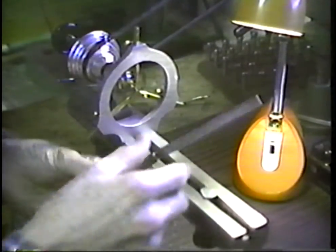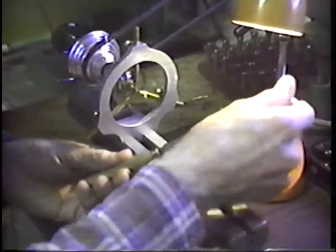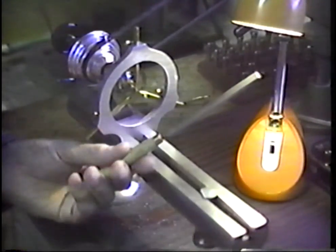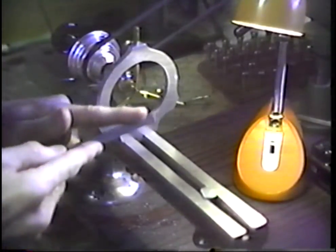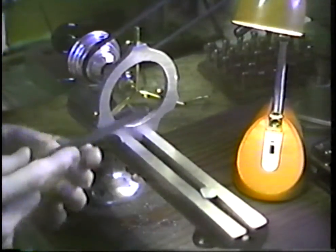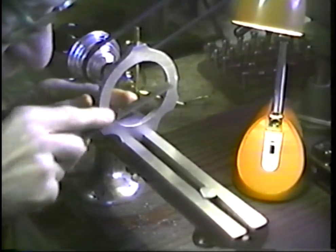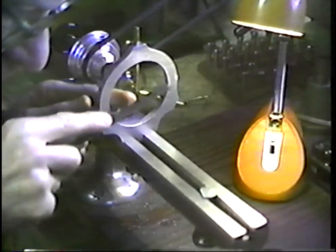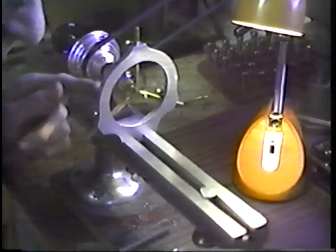Looking at this file, this has very smooth, safe edges. This is a number 6 cut. It is very old. This file is really more of a burnisher than it is a cutting file. So let's take this. We have the smooth, safe edges so that I can go very safe. These edges have been ground on this file to make that very sharp so that we do not have a chamfer. And we go on to this with a polishing operation. And see how we are now.